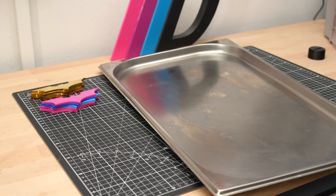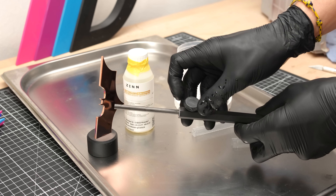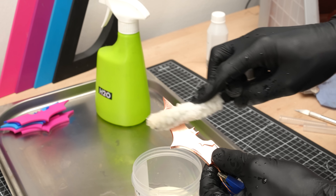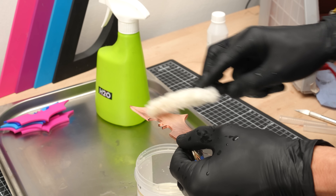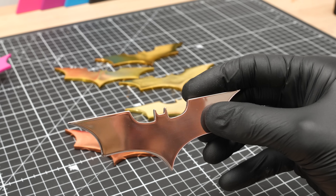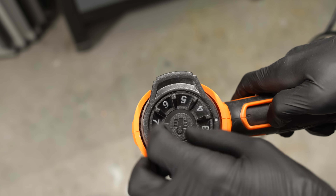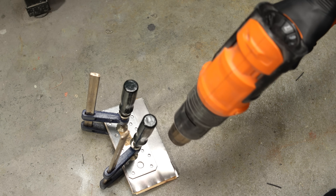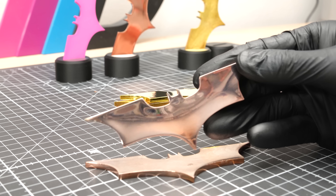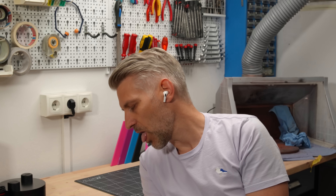Bronze — that's even more complicated, since it needs higher temperatures and probably more time as well. For this I use a tin electrolyte. I don't have much of it, which is why I apply it with a galvanic brush. This method is very flexible, especially for decorative layers, and it consumes far less electrolyte. I use a graphite rod as the anode and, at a constant 3V, brush several thin layers of tin onto the activated copper. Then I had the crazy idea of clamping the tin-copper print between two metal plates and blasting it with a heat gun, getting above 400 degrees Celsius. It actually sort of worked — though on the shiny print I totally overdid it and pressed too hard. The PLA was partially squeezed out by thermal expansion and the heat turned it completely black.